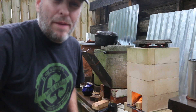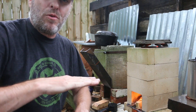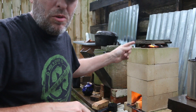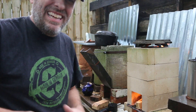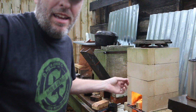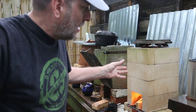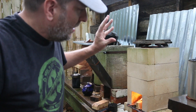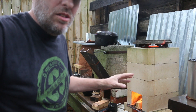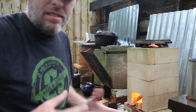What I am going to do when I make my bricks is go with 2x4s — so 1.5 inches deep instead of even just the inch here, which is doing pretty well. I think just having a little bit more structural rigidity would be a benefit. I'm going to make a rocket stove similar to this fire brick stove with my AirCrete bricks. I'll get some measurements off this, and since I'll be making bricks to size, I won't have to cut bricks.